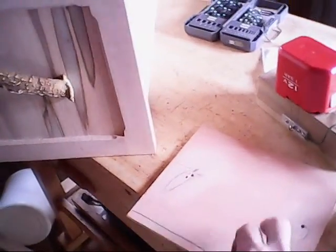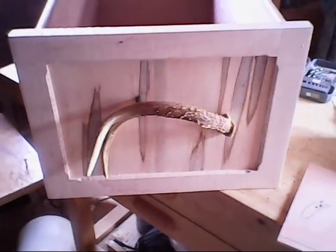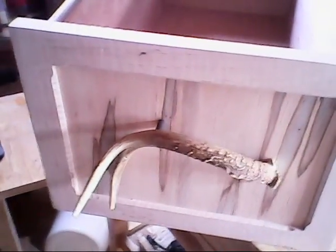Okay, that was just a demonstration of a technique I can use to line these up on the drawers by using some templates. That helps me get a square on the table so I can drill through a square. Also helps me to line it up on the drawer to get both sides lined up. And then once again on the drawer, I'm able to drill through the back side into the front to get the drill bit and the tap lined up when it comes to any kind of standoffs on top like this where it might be needed. Okay, that's all for now.